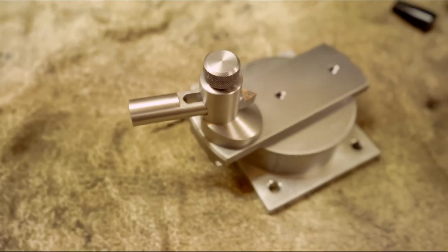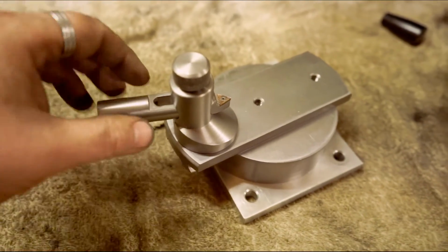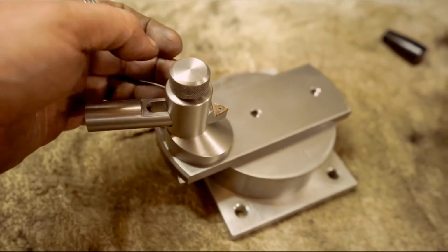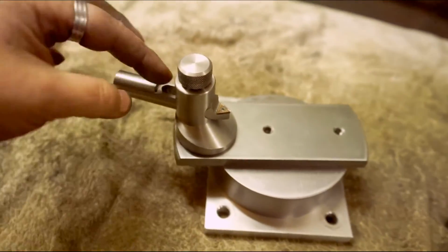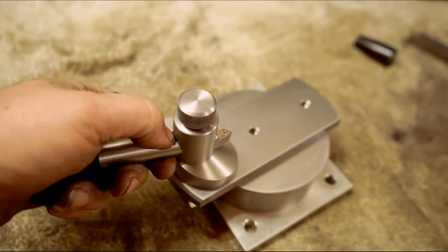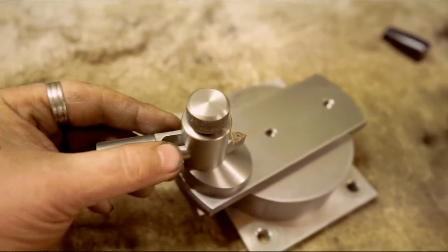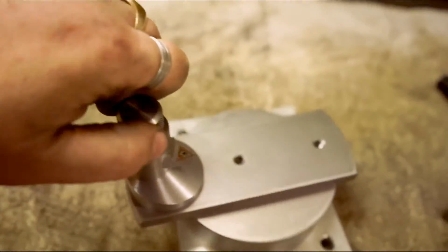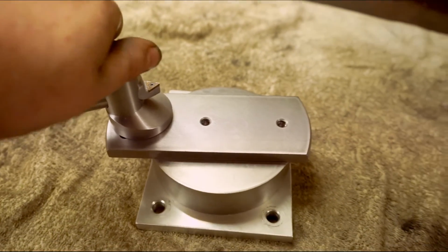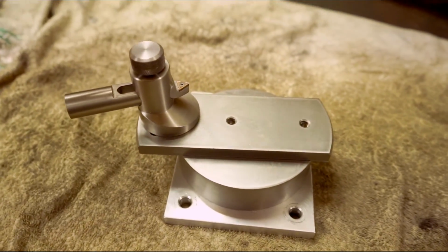So that's a bit of a naughty. I forgot to mention the creator that I got this idea from. I was thinking for a while how to bolt a tool to the workpiece. And he's got a post, and he had that idea of having that slot and the bolt through it, so it's like a dual acting. As you bolt that down, it bolts the post and the tool in one action. So that was his idea. That was Dr. Finn. I'll put a link to his channel in the description.